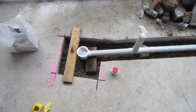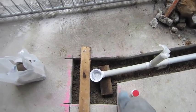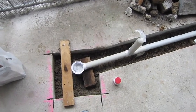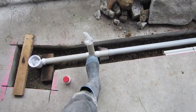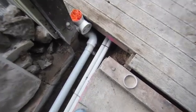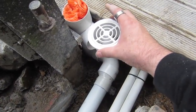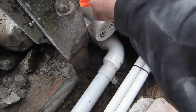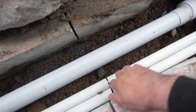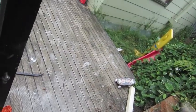So here's my plumbing. This is a shower trap because I'm going to have a shower tray in the bottom of the floor so that I can wash kegs and everything. Here's the line to bring in from my sink, and it comes along here. I'm going to have a vent that comes up through here. There's an existing down pipe that comes in, and I've got two conduit lines for my power to come in. But I've got to extend those out further so they go out underneath the deck and they'll be racing around to the other side of the house.